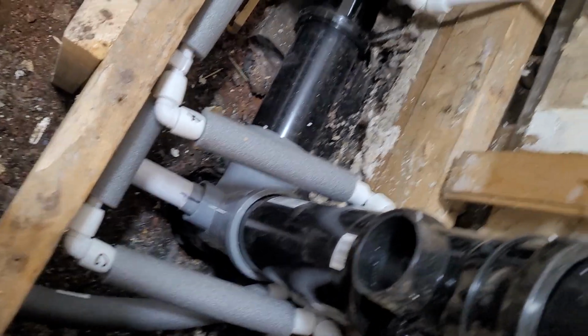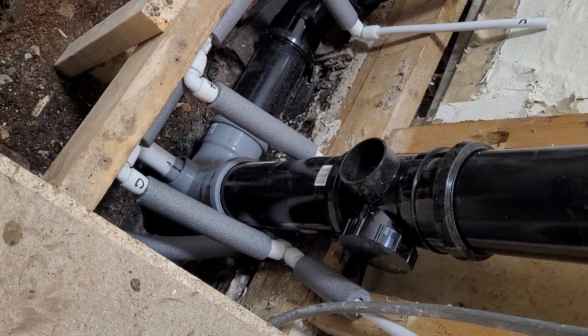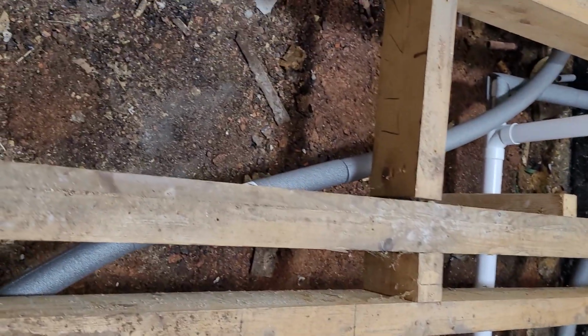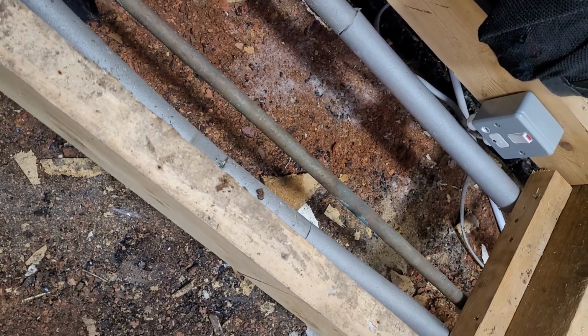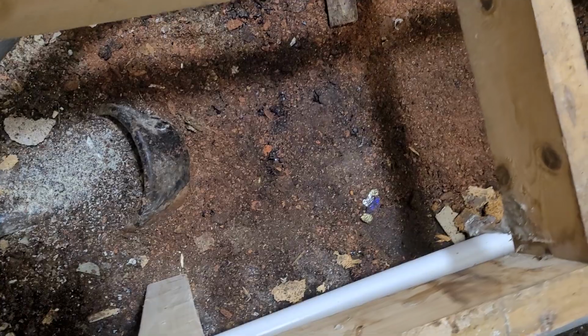So when you have a problem with the toilet stack, it then floods the solum, which covers the solum in damp, gooey stuff, which then, in return, your gas pipe's lying in it. So, for heavens above, Gas Safe guys, come on, let's clip up that gas pipe, keep it off the solum. All pipework, all clipped, off the solum.